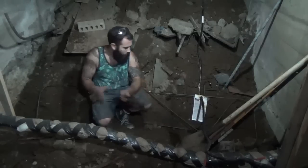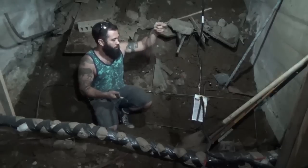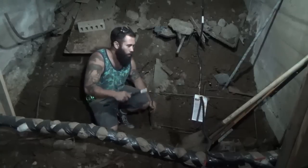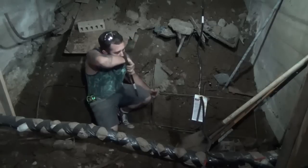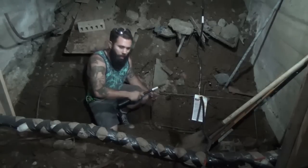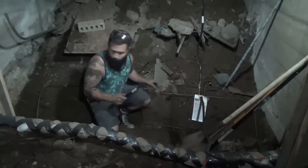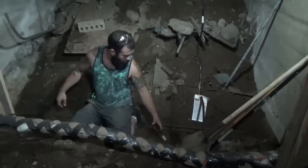So what I want is this rebar to come up from the concrete into the center of a core, so I'll pour the footer, put the block over top of it, you get up a few courses, then you pour concrete, so that way you have a good, strong, solid wall. The edge is pretty easy because you know where the core is going to be.